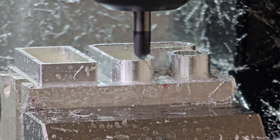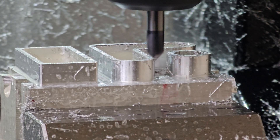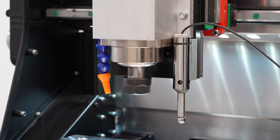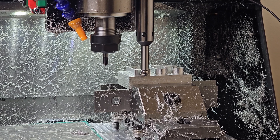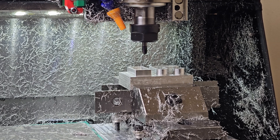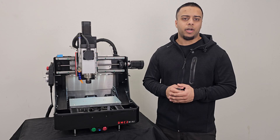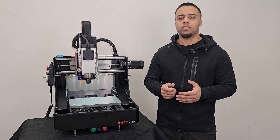Accurate probing is a very important part of CNC machining because you need to know exactly where your part is, especially if you're machining on top of something that already has existing features so that the two operations match up exactly. For probing on the DMC2 Mini, we have our magnetic XY probe that snaps into place when needed and works with the automatic X and Y axis probing buttons built into Mach 3 to automatically find and measure the position of your metal parts to within 0.01 millimeter accuracy. For the Z axis or tool height, we have our tool puck sensor that detects the height from the tip of the end mill to the surface below. With those three measurements for X, Y, and Z, you can have your part fully probed in and be ready to accurately begin cutting all within just 20 seconds.